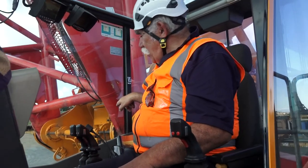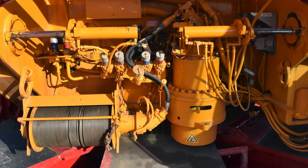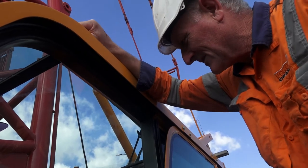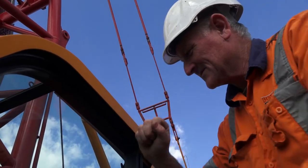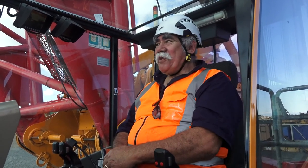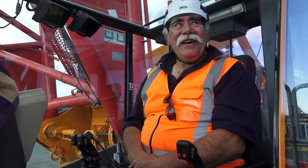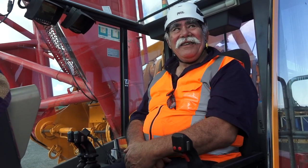There's a little winch just off to the side with a small rope on it - what does that do? When we're assembling the machine, we need to run out our hoist rope. Our hoist rope is 28mm, so it's quite heavy cable. We use that smaller cable to run it out - get it out to the tip of the boom and run it back to the hoist winch down in the body. We use that to pull our main hoist rope instead of muscling the big cable. It's an aid for assembling. This thing is shuddering a bit - maybe it's the engine. Maybe it's you.